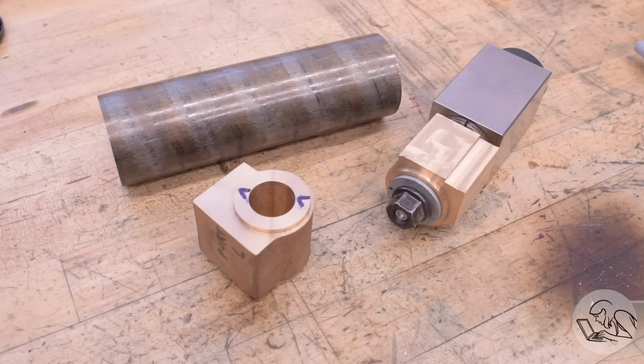I also considered some sort of repair. I could potentially silver solder some extra material onto the side of the casting and then machine it back down. Or if I had the skill and equipment to do so, a person could theoretically apply some bronze brazing rod to the area. None of those I think are going to make a very good looking repair, however, and the area in question is very visible.